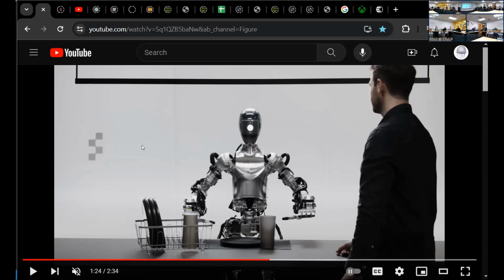About 10 years ago with my InMoov robot, which is built just using off-the-shelf servos, I had realized over the course of the project that servos were pretty much a dead end from a robotics standpoint. They operate open loop. You send them a command pulse, and eventually they'll get there at some speed, at some acceleration. And when they get there, the dead zone is plus or minus 2 to 4 degrees. So they're not accurate. You have no idea where they are.